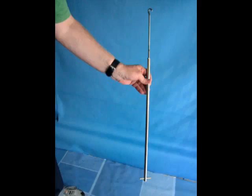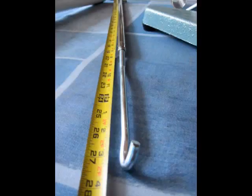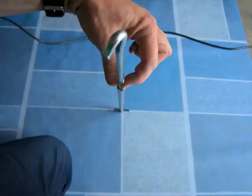Now for the control linkage and turnbuckle adjustment. Before installing, make sure the turnbuckle is adjusted properly. We have found that an overall length of 27 and a half inches works best. Also, the position of the hook in comparison to the base crossbar is important. If you were to look at it as a clock, the crossbar at the bottom should be at the three and nine o'clock position, while the hook at the top should be at the seven o'clock position.